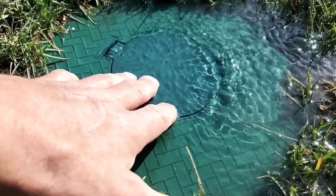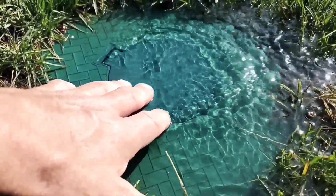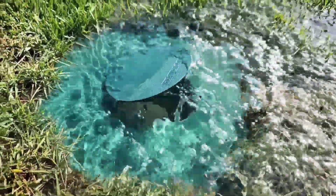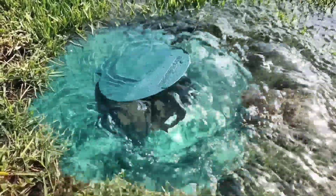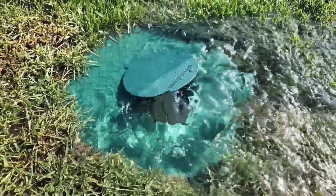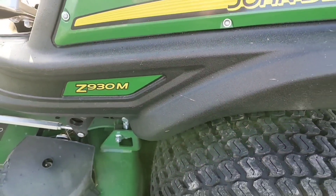This also helps in the wintertime if there's snow piled up on the pop-up emitter. When we have a thaw, the water is going to run out of the hinge, around the lid, and it's going to melt all the snow. You can see the flow of water coming out on stage 3 — the flow of water was the same in our demonstration of stage 2.